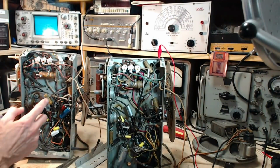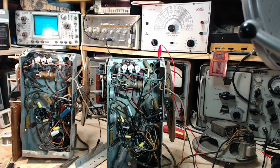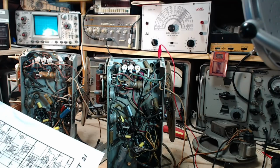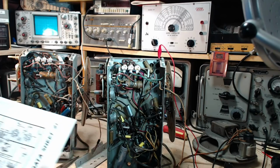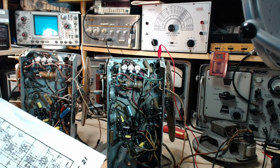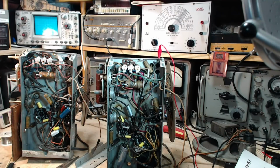0.01 written right there. So I really should change out these two capacitors, even though they don't seem to be causing much trouble. But let's get rid of them. Same thing over here. This guy's brother turned out not to be in good shape, so we'll change him out. But I wouldn't expect any performance variation in the radio. Okay, so I'm going to go ahead and do that.